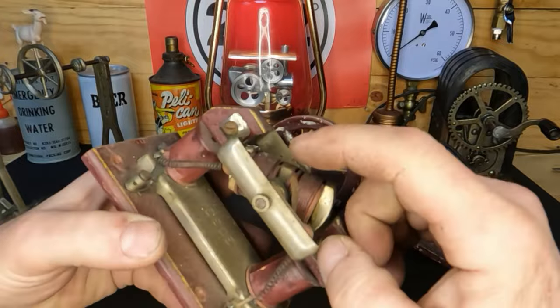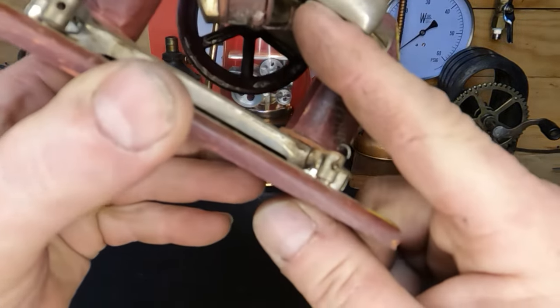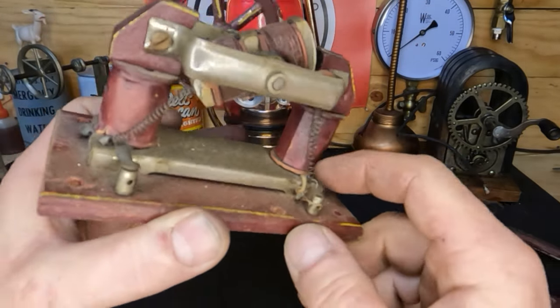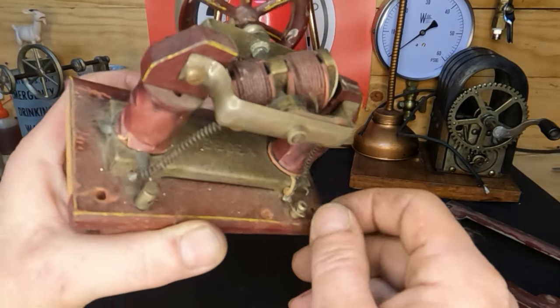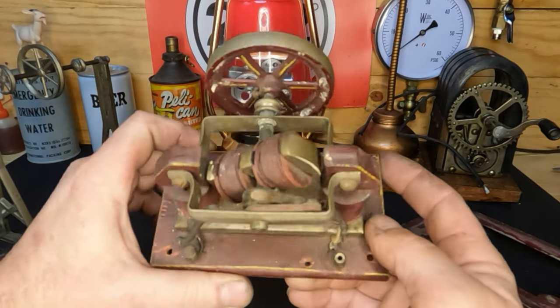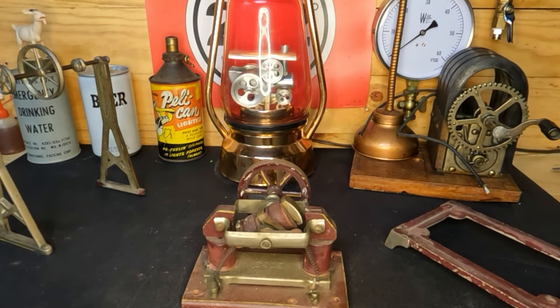You can see that this brush right here isn't touching down — the bottom one appears to be making contact, but our brush wire is not attached on either of them. Our field is hooked up on that one but not over here. We should probably check our field coils to make sure this is even going to be usable. Let's grab the meter and run a check for continuity across it.